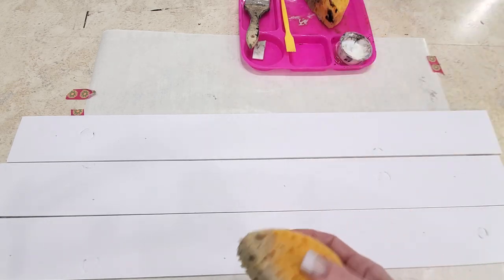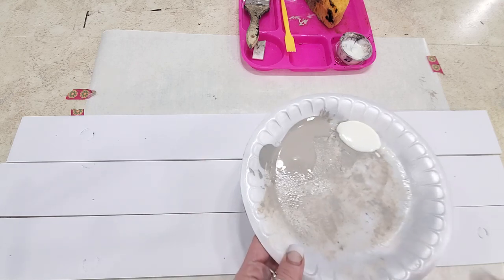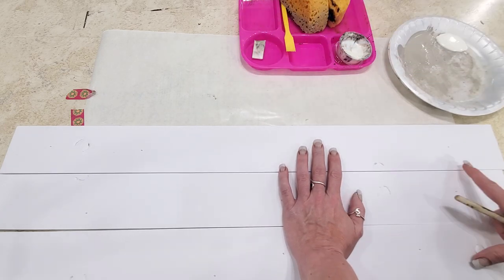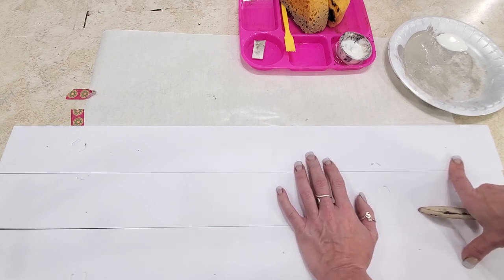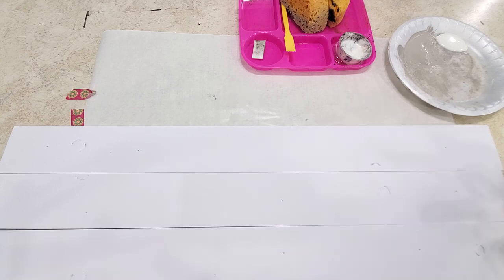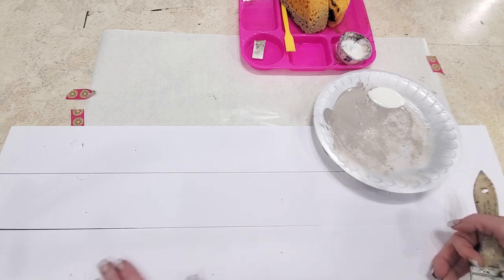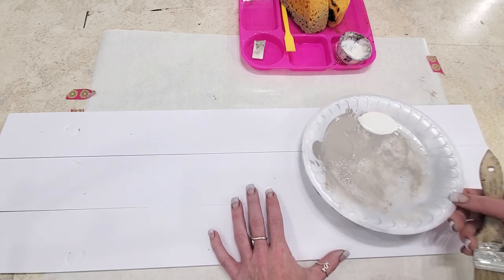I've already poured some of the Waverly mineral and this is the wax, and this is just where I'm going to be blending it out. One of the things I want to point out is that the wax is almost a necessity - this is truly just a thin piece of paper, and if you've ever just painted acrylic or chalk paint on this, you know that this top paper layer can curl, the whole thing can warp, it can peel off. It absorbs too much moisture with the regular paints; using the wax in with our colors almost helps seal this surface.